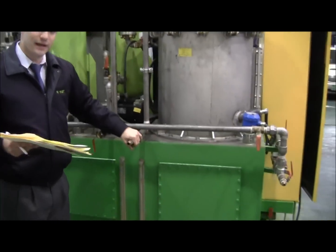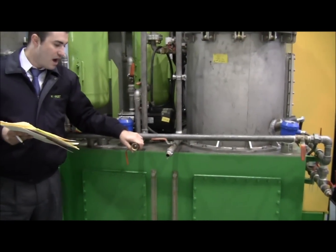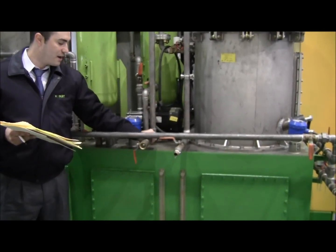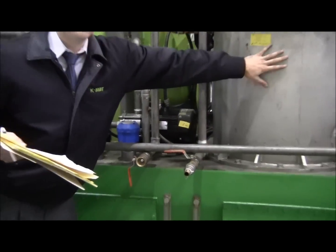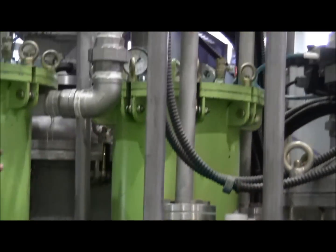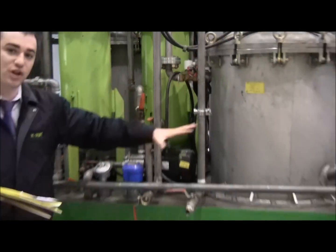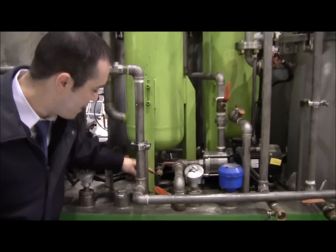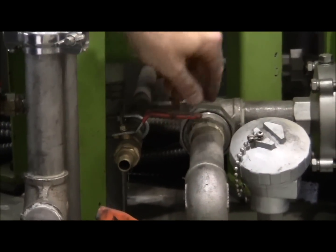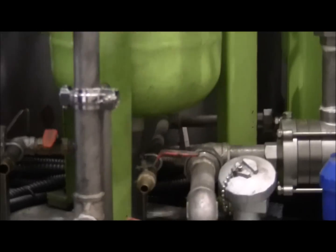We'll come over right here — this is diesel in. This machine right here will tell you the recommended requirements. But this right here, you put water in it, and what it does is clean and wash out all of the tanks: diesel tank 1, diesel tank 2, the emulsion tank, and the mixer tank. Put water in and it'll flush it out. These on and off valves right here are hooked up to the water tank in the back. The impurities — once everything's filled — you open this up and they'll come out.